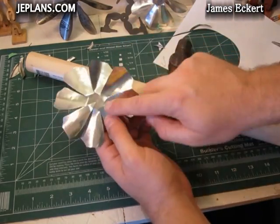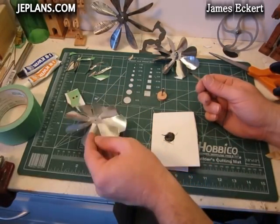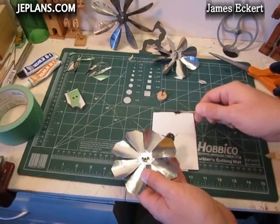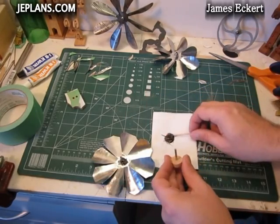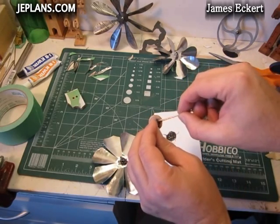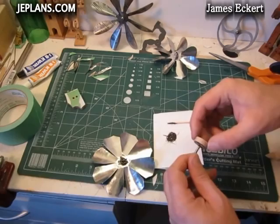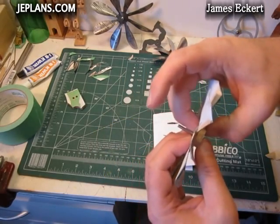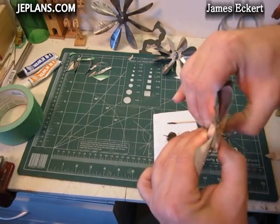We'll score this surface and I'll make my disk that's going to go in the center. It's a scored surface. In this case I'm using just fast-drying epoxy. I have a little bit of a shaft here to make sure it stays centered. I'll just pound the shaft out when I'm done. I'm going to clamp it with something opposing on the other side and clamp it together like that.